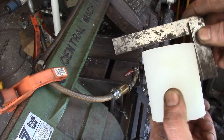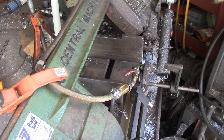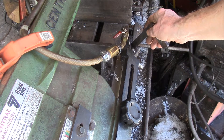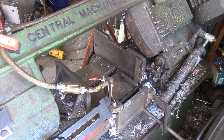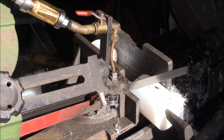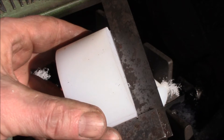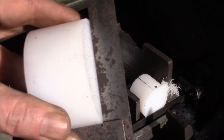I could adjust the angle to fix the verticalness of the cut, but doing so I threw off the squareness. Then if I tried to adjust the squareness, the vertical went out. I was just chasing back and forth and couldn't get both things fixed at the same time. So I figured: take it apart and find out what's going on. I should also check this other guide — I hadn't paid attention that one bearing post is eccentric and the other is concentric. Let's see how vertical this goes — it's touching the square pretty much the whole way up and down. That came out pretty good.